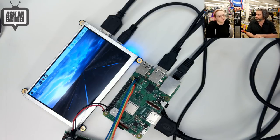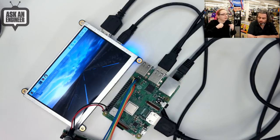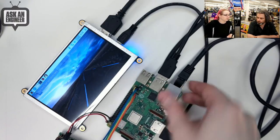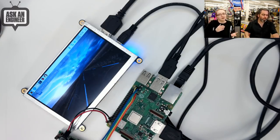Yeah, you'd have to have 50 power supplies, and that gives you another place that something will go wrong. And the micro USB connector is good, but it's not going to be as strong. These Ethernet connectors, because they have the clip, don't come out, whereas the micro USB you can pull out. With these, you actually have to flick the cable, and if you have a boot, it's protected. So this is more durable, and also means you get both data and power. Great for Internet of Things projects.